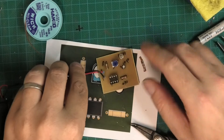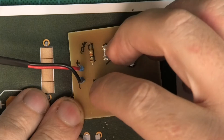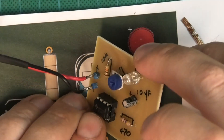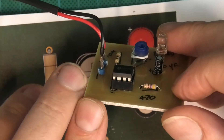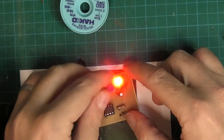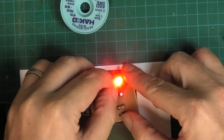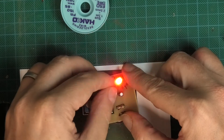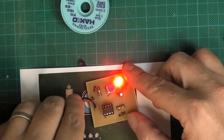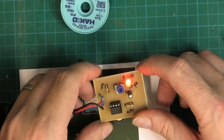The last part is just to put the chip in, following the notch for notch. By using the chip holder you can see that the soldering iron has never touched the chip. We've definitely got the flashing working. Can I change the speed using the variable? And you can see that it is changing. So that's it — from simulation to actual.